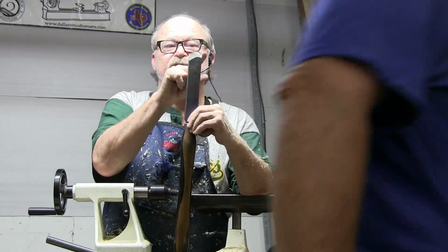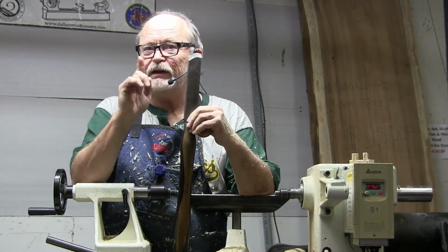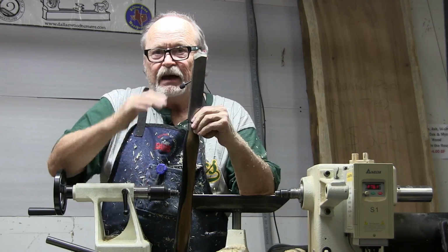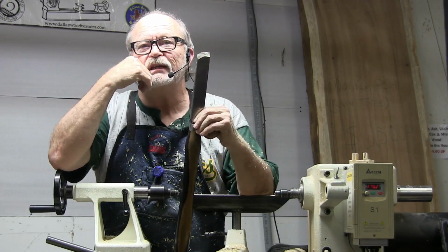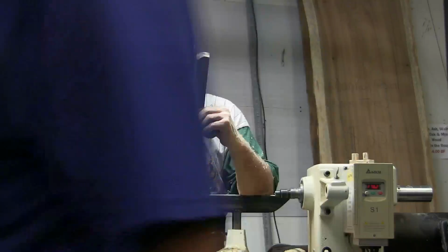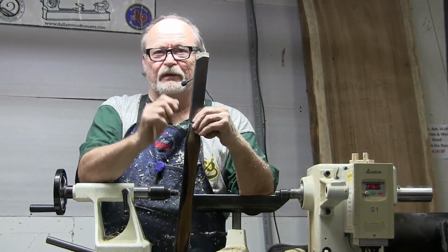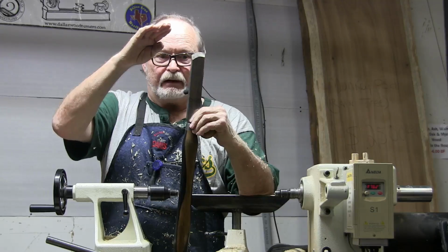It's 70 degrees from point to point. It's still 70 degrees. Don't lose that. If you pull this around too far, you can't find it. If you don't have it far enough, it's trailing too close to the wood, you'll get more runbacks and dig-ins. So the 70 degrees is still operative, even though it's a curve. It's straight and then a curve.